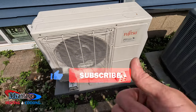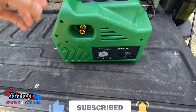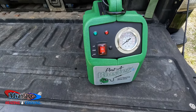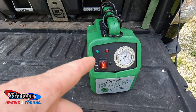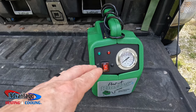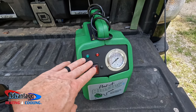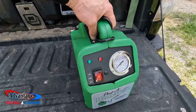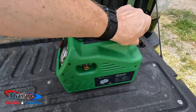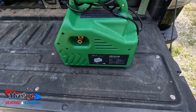If you got any value out of this content, smash that thumbs up button. I got this porta blaster on Amazon — I'll leave the link in the description below. This is probably going to be good for evaporator coils on a furnace. I wouldn't use this on a mini split again, just because it is pretty messy and it doesn't have the right angle tip — the nozzle just blasts it out.